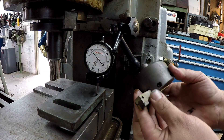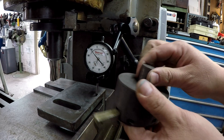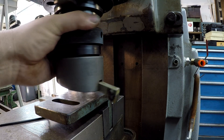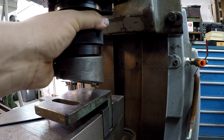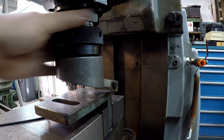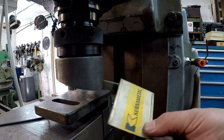I think we're going to fly cut this. We've got this big fly cutter right here — it takes a little TPG insert. I'll use that because I'll be able to cover the whole width of that at one time. We've got the fly cutter mounted in a collet chuck, already stuck out and centered on the part with about equal overhang over each side of the angle plate. This uses a TPG 200 series carbide insert.